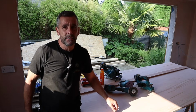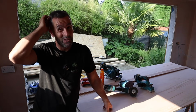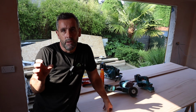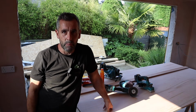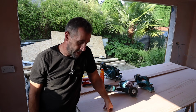Now, the last cedar clad door we built on video, when it opened, Jenny looked at the back of it and says, what the hell, because it weren't cedar clad at the back. The reason why it weren't cedar clad at the back was external door is 44mm. You've got 18mm cedar on the front and 18mm cedar on the back, you end up with a door that's like that. We're using Parliament hinges as it is, but the door became too thick to cedar on the back, basically.